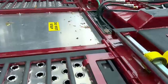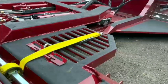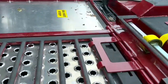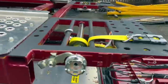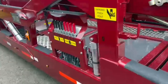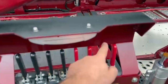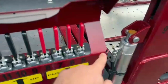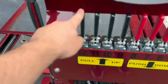These drop about five inches — if you lift those up you can put a vehicle onto these extensions. But if you've got something like a pickup truck or SUV down here, leave these down to drop the height. Hydraulic bank for the trailer — you've got your slide. The red ones are obviously for your upper deck and lower deck; first one in the belly, second is your number nine deck up and down, and then your slide for your rear.